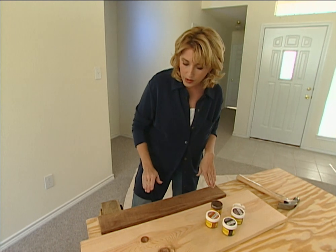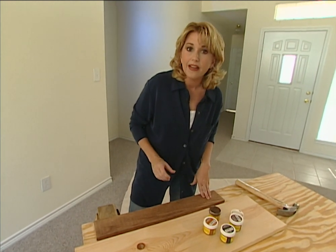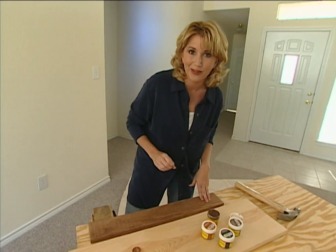Finally, you want to put one more coat of clear finish over your wood. This will help hold the putty in there because it is still soft under the surface.